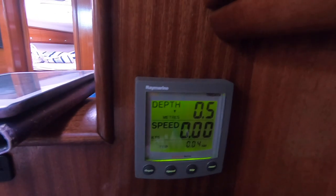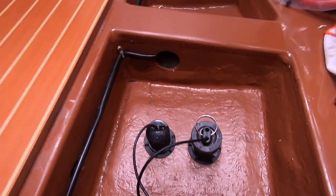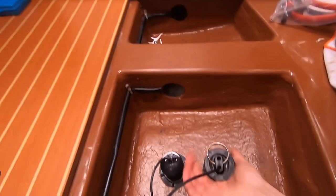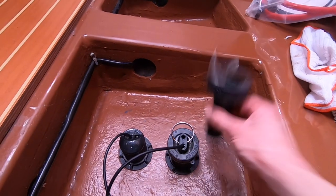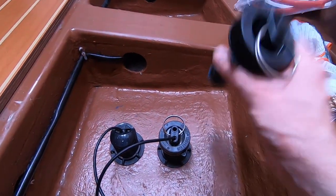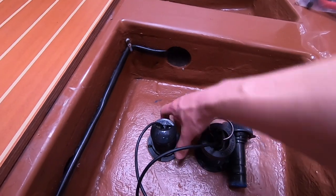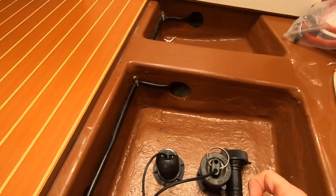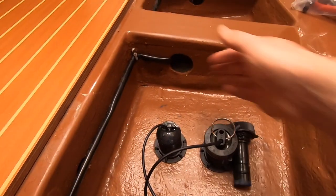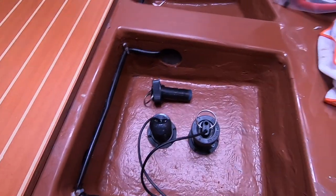We'll wait until we get a little bit of tidal flow and hopefully that'll move around nicely. I've dried all around this just to make sure we haven't got any leaks, which we haven't, so we'll check that in another hour or so just to make sure everything's okay. Just hand-tighten these. If you look at this one, there are actually two rubber seals at the top — a seal here and a seal right at the very top. It's always a good idea to keep the bung near this, because you can take this out and if anything happens or it fails, you've got that straight away to shove in and hopefully save your boat. For the through-hull fitting you can't take any of that out, so the only thing you could do is knock a wooden bung in. It's always a good idea to have a set of wooden bungs just in case something happens with the transducer or a seacock. Hopefully that's all finished and the speedo and the log will start to work.